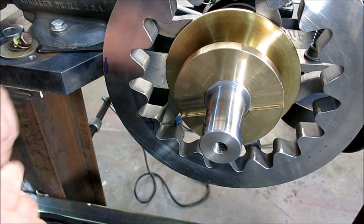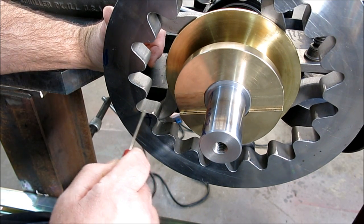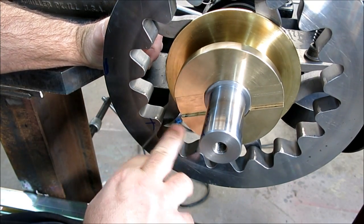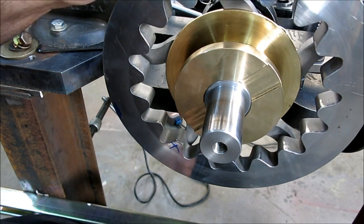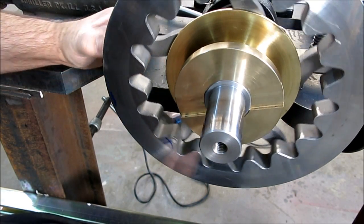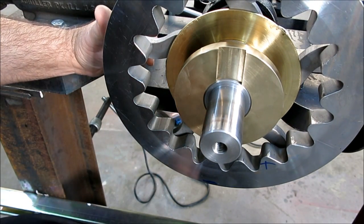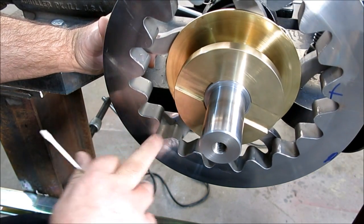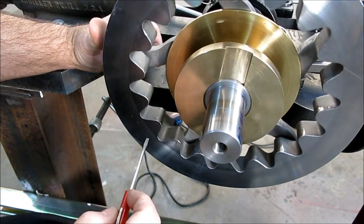So I'm going to mark those. What I want to do is go back and where I see those kinds of marks, I'm going to take a little bit off of that area. I'm just going to use a little drum sander and kind of go over some of that to take some of those off. Then I'll run it again. I'm not looking for a perfect contact pattern — this isn't like a high performance rear end or something like that. But I do want to note any tight spots. I want the thing to run smoothly and quietly, and it'll just get better with age as it wears itself in.